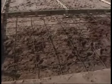Sometimes you're called out to do a first phase inspection. The slab has already been poured. That limits what's available for you to check. Now, we're going to go up on top of a slab that's already been poured, but before we do that, we want to look at where they're going to put the driveway. As you're going to see in a moment, the first section, 8 to 10 feet, where it ties into a public road, is required by the county to have steel rebar. As you can see, the first section here has steel. That'll be raised up with chairs before they pour to keep it in the middle of the slab.